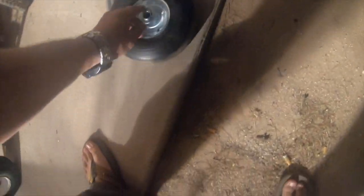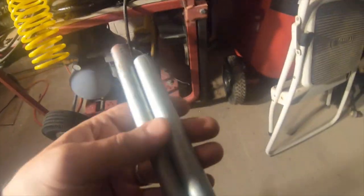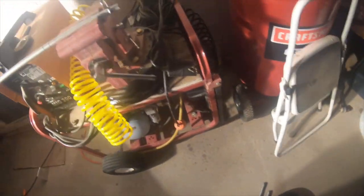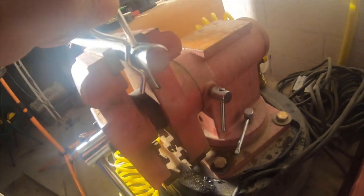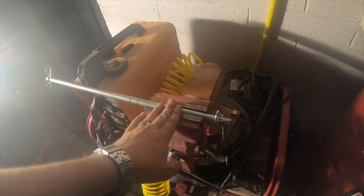They're just seven-dollar, six-ninety-nine rims with solid rubber tires. I got the actual new shaft cut and shortened and drilled for these pins. Here are the pins — I used an 11/64ths drill bit in a five-eighths shaft.